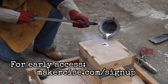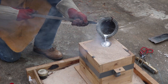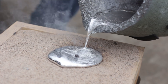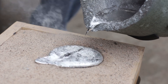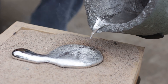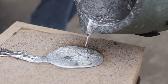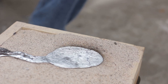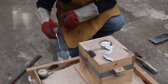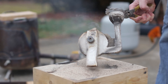The second time around, I made the pattern and mounted it upside down on the arbor so that the channel for the downfeed screw was at the bottom of the pattern, which I thought would allow the metal to fill that bottom part before it got to the chill. The second time around, I had an entirely different problem: too much moisture content in my refractory. I hadn't allowed enough time for it to dry. The moisture trapped in it boiled off during the pour — you can see it distorting and wiggling the pool of molten metal at the top. In the end, the casting turned out usable, so I proceeded with it. These are lessons I'll integrate to make better castings, and I hope you can also use this information to improve your casting success with the lost foam method.